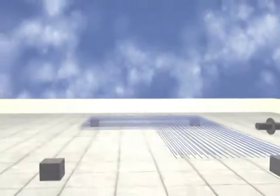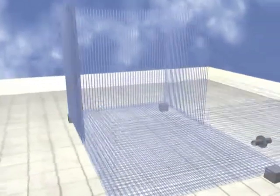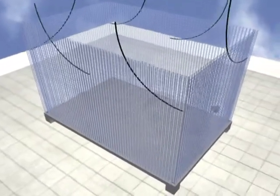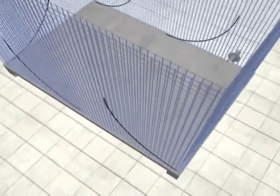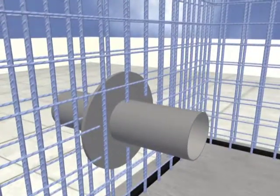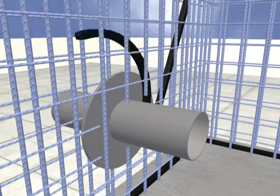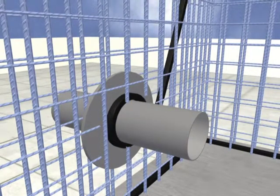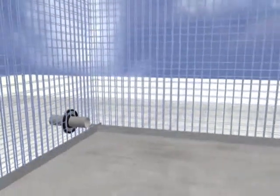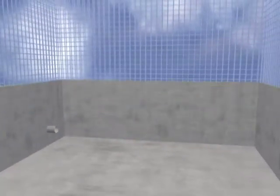In concrete water tanks, to prevent the problem of leakage through the joint between the wall and the puddle flange, Dr. Fix-It water bar is an ideal solution. The water bar strip should be placed on the surface of the puddle flange closer to the water. It should be placed on the flange in two places, around the pipe and around the outer perimeter of the flange. After this, the wall can be cast.